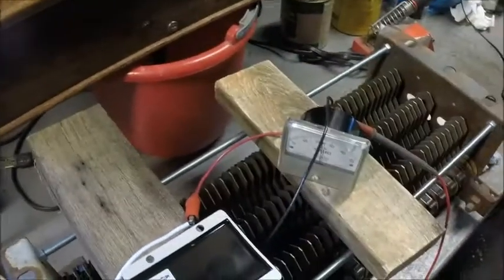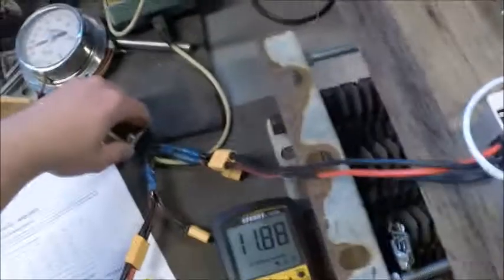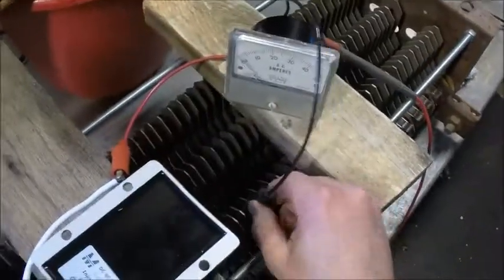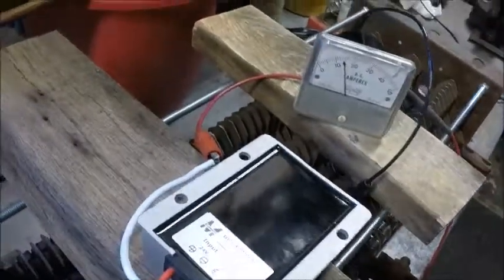This is quite good — I'm very pleased with this. Let me get it exactly to 20 amps so I can measure that. That's 20 amps exactly at 11.88 volts. Again, 11.88. That's 15 amps at 11.98 volts. That's 14 amps at 12.02 volts.